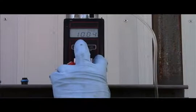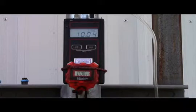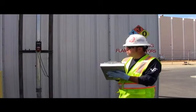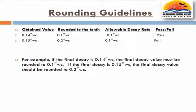After the 10-minute settling time, the tester reduces or raises the pressure to within a range of 10.0 to 10.04 inches water column and begins timing the decay rate. Pressure measurements are then recorded every minute to the nearest hundredth of an inch water column. As final decay rates are specified to the nearest tenth, rounding is done only after calculating the overall pressure decay rate.